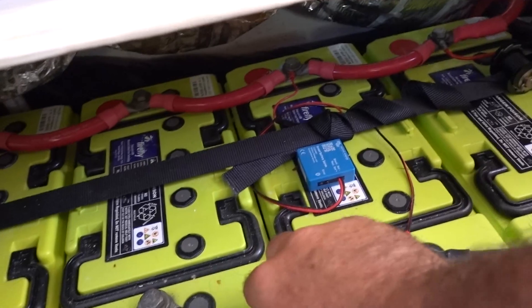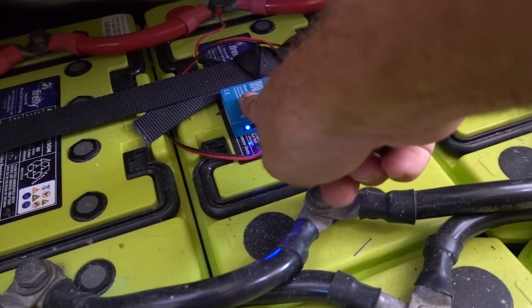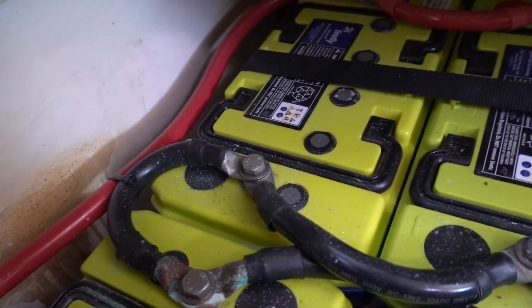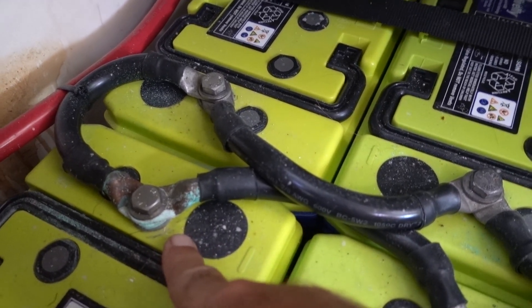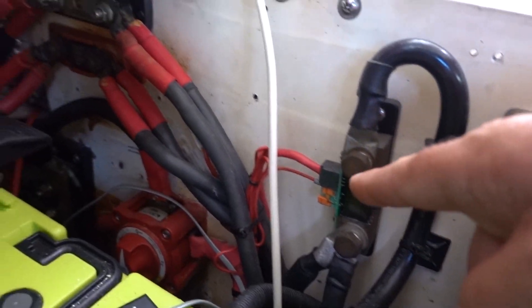So we've shut off all the power. We're going to take the batteries all apart and see if we can clean them up. There is a little bit of corrosion. We'll clean all the connections, check to make sure everything's tight, and then try it again — and hopefully it's not our inverter. You can see the connections are all very tight. There's the Magnum sensor and the battery sense for the Victron. All of the connections I've checked are very tight, but we do have some corrosion buildup — and these are discolored too, which is not acceptable. We're going to take them apart and clean them all up, then try again to see if we can get them to charge up to 14.4 volts.